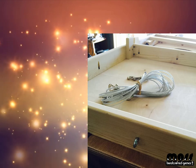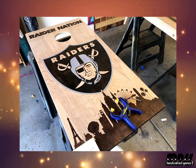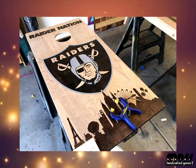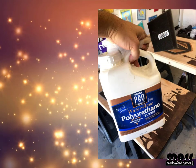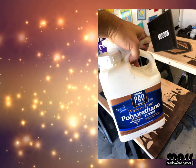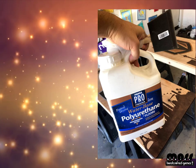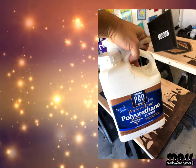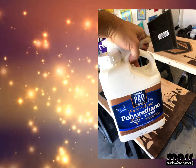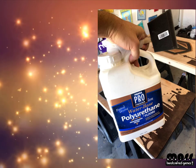Post in the comments if you have any opinions or questions. To finish your boards, for supplies I like to use a water-based polyurethane from Pro Finisher — it's a Rust-Oleum product sold at Home Depot. This is a great product made for wood floors but it works really well for cornhole boards. Because it's water-based it'll dry completely clear and cleanup is minimal.